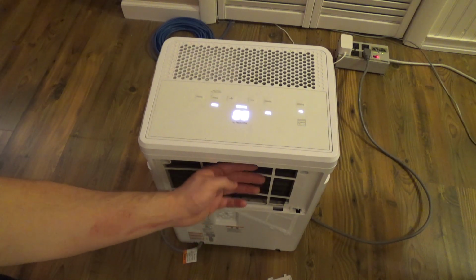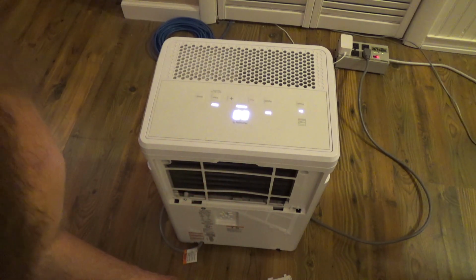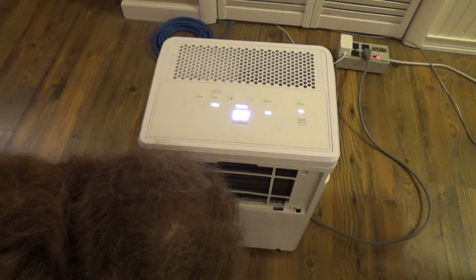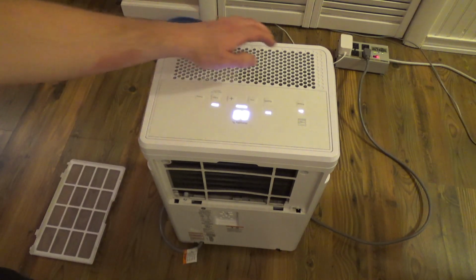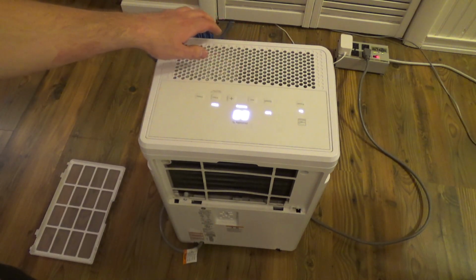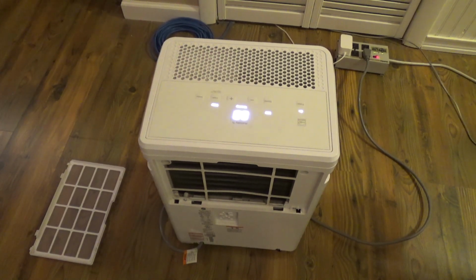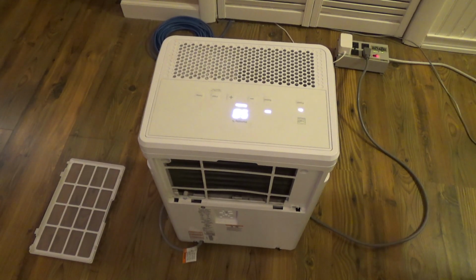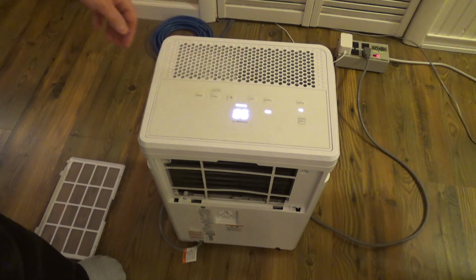It's not really getting cold yet. A little bit, but not too much. Yeah, I can hear the gas going through. I think it's going to work fine. Pretty much ambient temperature still. I'll let it run for a few minutes and then we'll get my thermometer. That definitely sounds like the compressor is under load now. The air coming out is above ambient temperature.